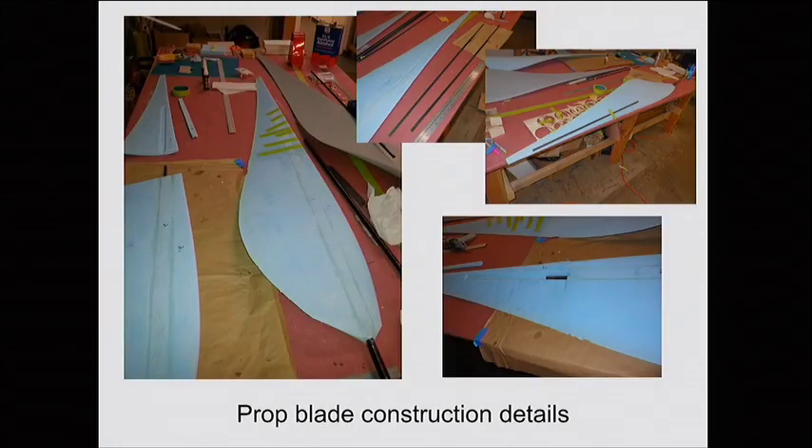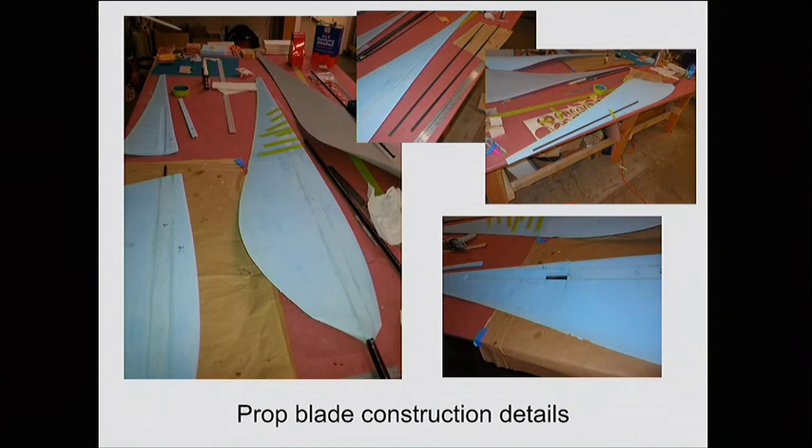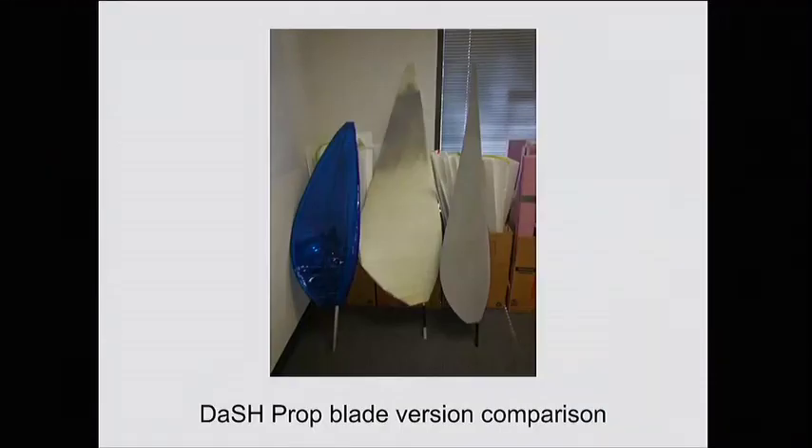This is the prop in process — you can see the prop spar here. When it gets too thin at the tip, there's just a spar cap by itself on each side. This whole thing gets encased in two layers of very lightweight fiberglass, which makes it a lot stronger and stiffer. Learning our lesson from that break and trying to better distribute the stress, we eventually tied in this part of the prop spar with some carbon fiber. The spar caps are machined into a groove and then laid in, with some filler to get it nice and smooth. This is sort of the three generations of our prop, and the latest one is what we've actually used to fly the plane.